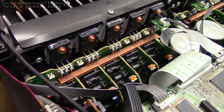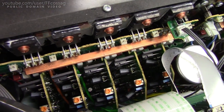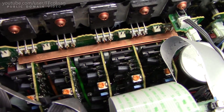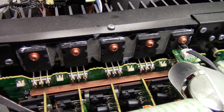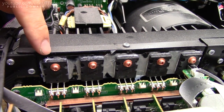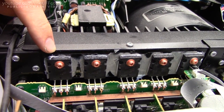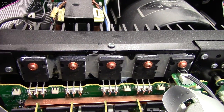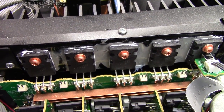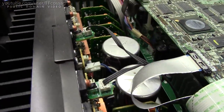While we have the opportunity, here's a bit of a close look at the power amplifier sections — very tidy, very high quality. There are bias pots on the top there, and the main output devices are labelled TTA-0002 and TTA-0003, made by Toshiba, one per rail per channel. And all brand name caps, of course.